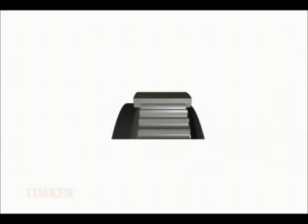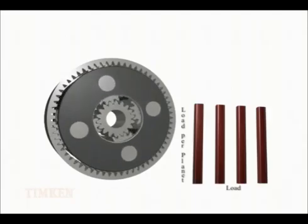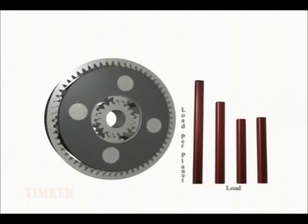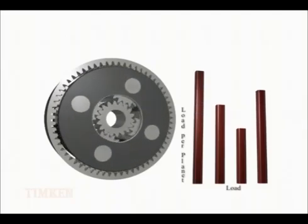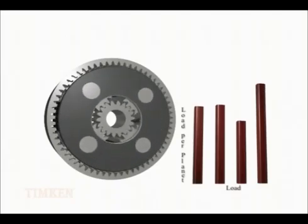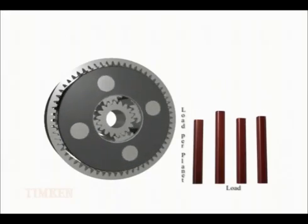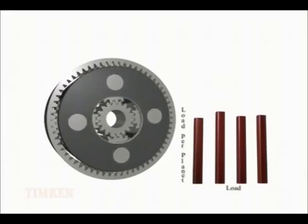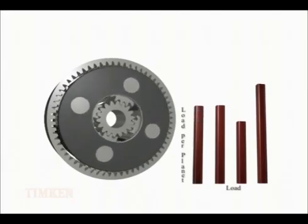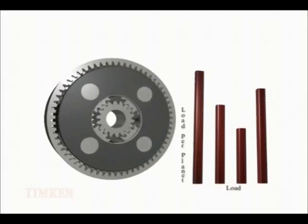Another consideration about conventional planetary gearing systems is the load distribution among adjacent planets. In this view, 4 relatively wide planet gears revolve around the Sun gear, in theory splitting the power onto 4 equal paths. However, since the planets are fixed in a rigid carrier, manufacturing tolerances affect the mesh points and loading becomes unequal. Gear design standards account for this by specifying that the design load should equal 33% of the total load instead of just 25%. This increases the required mass and size of the conventional system.